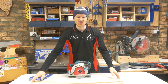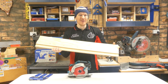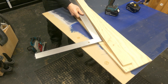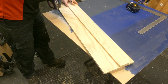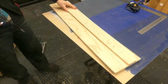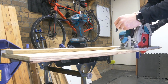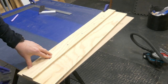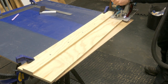Next up is my poor man's track saw. This was the first jig I ever made and I just remade it on video for you. The important thing here is that this is a factory or very straight edge. You want to screw it down to a slightly wider board, making sure that the width of that board is just a touch wider than the base of your circular saw. After we've screwed it down nice and straight, we run our saw through, take off that edge and make it parallel to our guide — and we've bang straight away got a poor man's track saw.